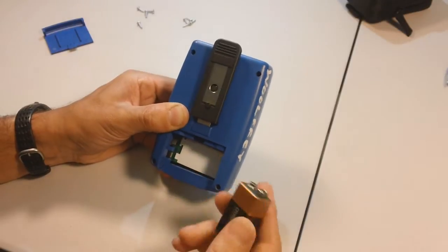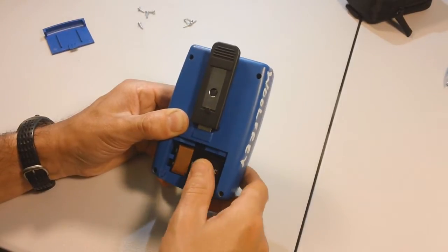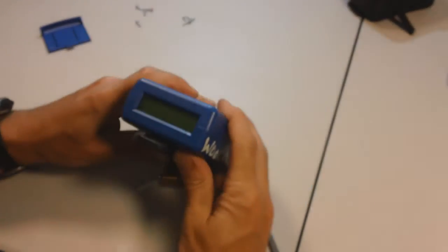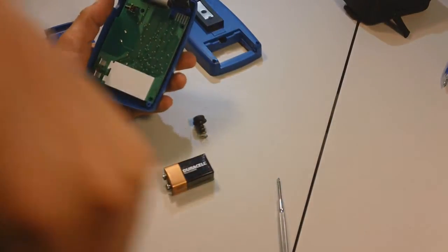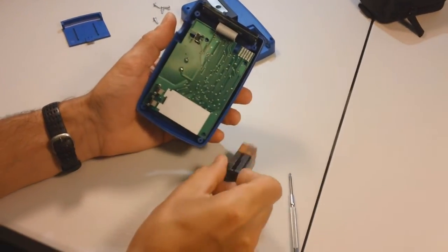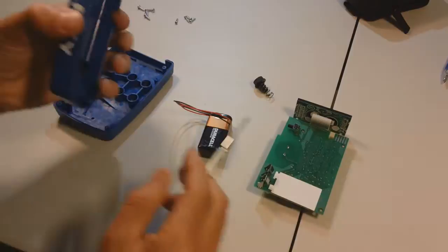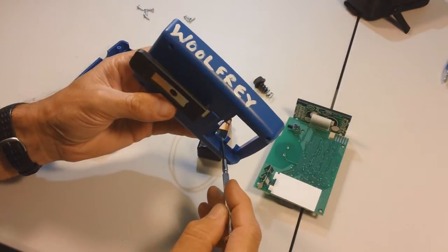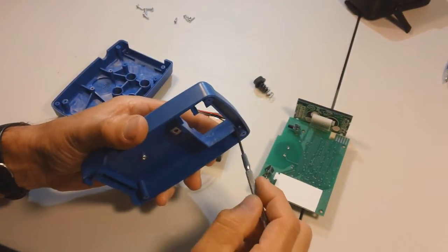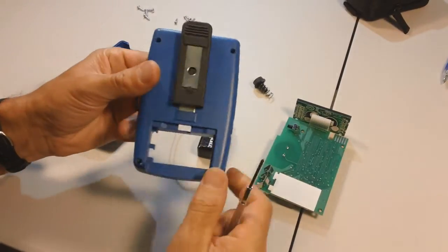If the leads are bent, one a little more than the other, that will push the battery away and you will not have good contact and the thing won't work. So you need to get rid of this and put a battery clip on there. We're going to have to unsolder these two clips, take a pocket knife or some type of file, get rid of that little plastic tab and cut away this wall right here so the battery with a clip will fit in this hole.